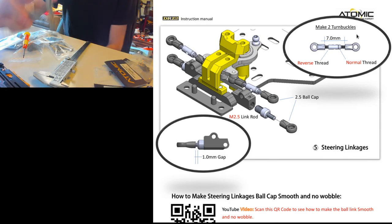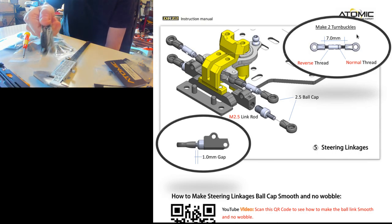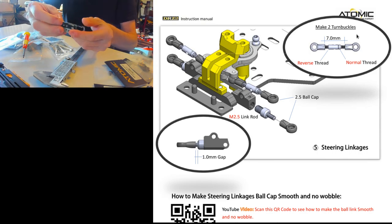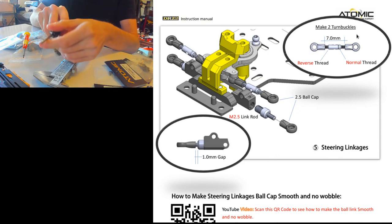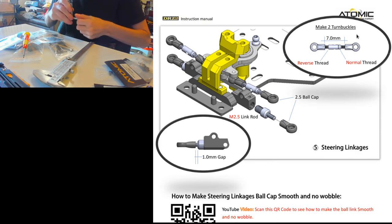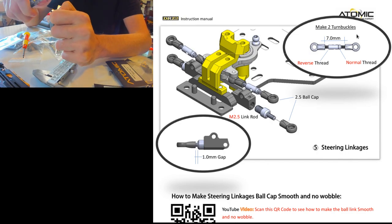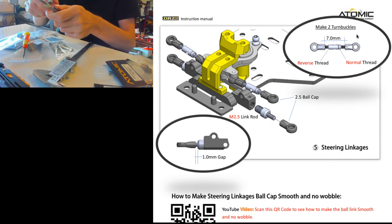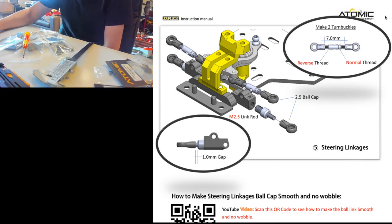So the other ones I've got are these. These are all Leatherman tools. You wouldn't typically think to use Leatherman tools, but this one especially is useful in the field. The reason being is, A, there's no knife on it, so you can take it on an aeroplane, but more importantly, it's got this file with a semi-pointed end, and this turns out to be almost perfect for prying batteries out of things, so I like it for that. But having just a pair of pliers on there as well is generally useful. I normally use this for gripping shafts for shocks and popping heads off and that sort of thing, so over the last couple of days, it's been an absolute lifesaver. And I've got a third one, another Leatherman, but I'm probably not going to use it at this point. The head just isn't nearly as fine, but if I have to hold something with a lot of force, I might grab that out.